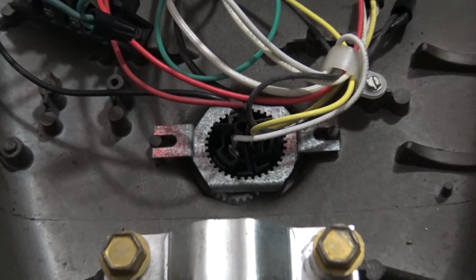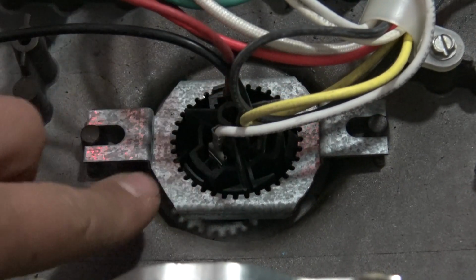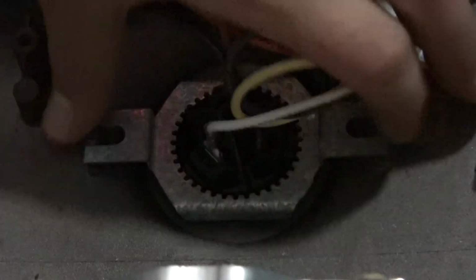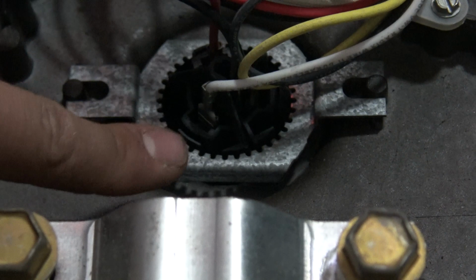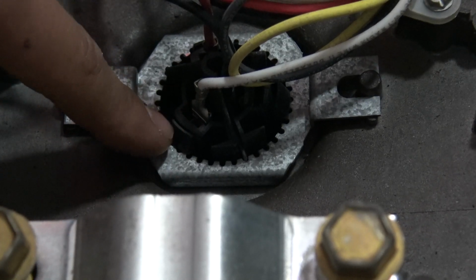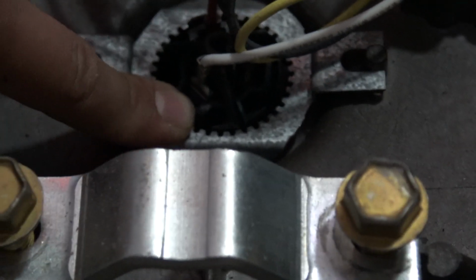And then of course here you have your photocell socket. Like I mentioned in the last video, and I'll mention it again here, this is a one-time snap photocell socket, and you can kind of see that this one's kind of off. But if I can position it right, there's a clamp right here. You can see it's actually pushing out. There we go. You can see it locked right on there, and it just clicked just now. To get the photocell back out, you just push down on that, and then there's another one up here.